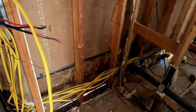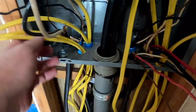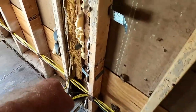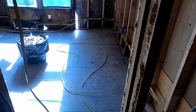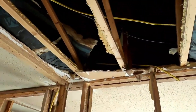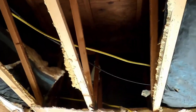Now we're getting somewhere. Actually, I have to take some of these back out and put some grommets in them. I just didn't put the photo. Sorry. Got my corner in. This situation's gonna be dealt with. This one's looking pretty good though. I got lots of wiring. Things are opening up. I was able to run some stuff through the ceiling that wasn't there before. There were no ceiling lights in these rooms, they were on the walls. So since I have this open and I have access, I'm going to run some ceiling lights up and control them with all new wiring.